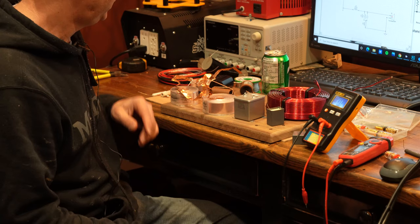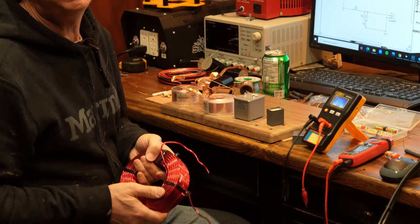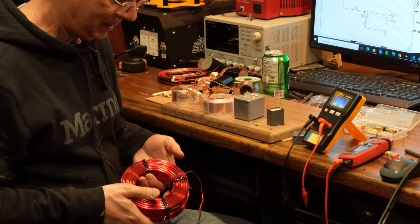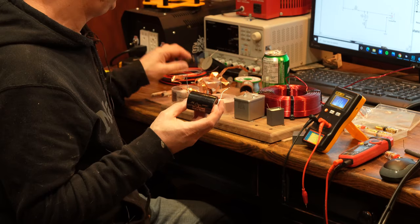I sourced some really good components. We've got some foil inductors — I got three of them. We have a big huge 10-gauge inductor for the woofer. I didn't want to go with an iron core and I didn't want too much resistance, so I went with 10-gauge. I didn't realize how huge they are, but in hindsight 12-gauge would probably be just fine. We've also got a whole bunch of really good Mundorf MCAP Supreme capacitors — mostly for the tweeter.